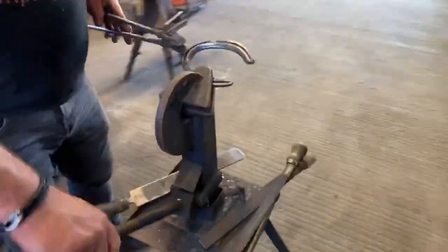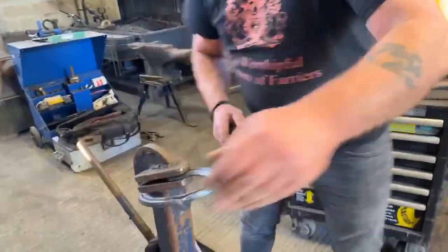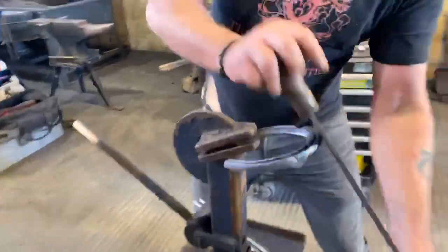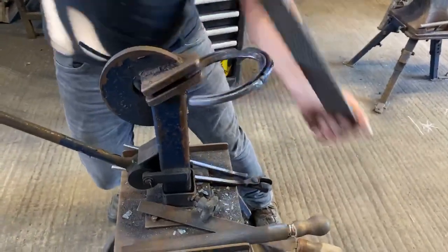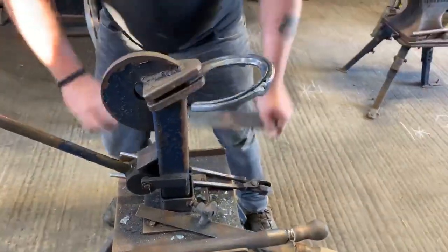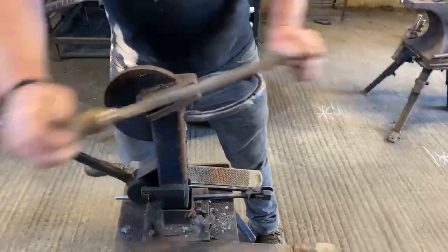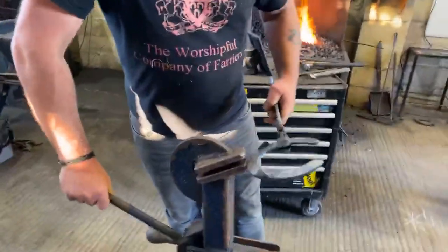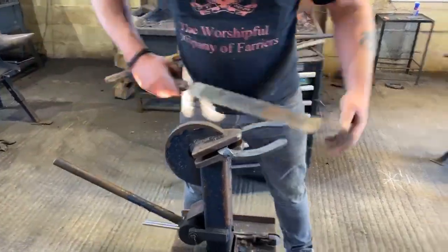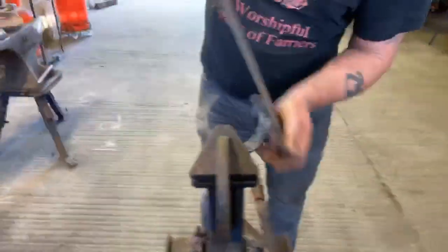Before I box it, remember, we haven't done the toe yet. It ain't gonna take a lot. We've done the inside of the toe. What we've got to do is go flat over the top and at the angle we forged the edge over. And again, go over with the file. Then lastly, inside branch, box him off. Not as much as you do on the outside, but you're still going to get a little bit, unless it's a hunter.